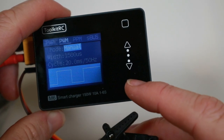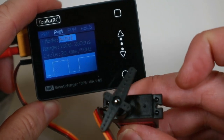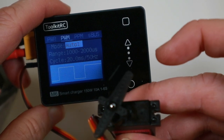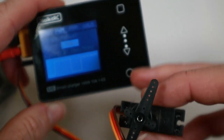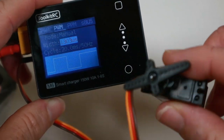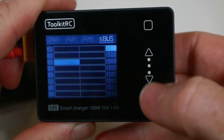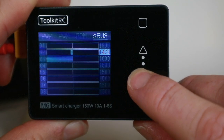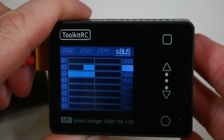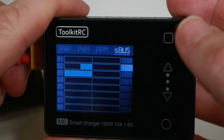So the PWM is an excellent way of testing something like a servo - oh look, here's a servo, let's plug it in. I've got my servo; if I press OK that's it on manual at the moment, so what I can do is just go into another mode like auto 3 which is a fast one, and then we've got ones that slow it down a bit like auto 1 and auto 2, and obviously I can put my own frequency in just by going down here and holding down a button - you can see the servo move. Things like PWM output and SBUS output are slightly less useful; basically this would put this whole thing out and then you can say okay I want channel 2 outputting a certain value and that will go out of the SBUS. I can't see many options where you'd want to use that - perhaps if you hadn't got a receiver to rig it up yet - but slightly less useful I guess.